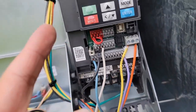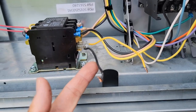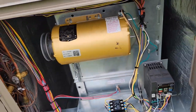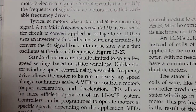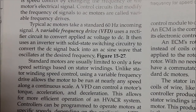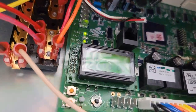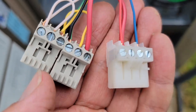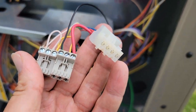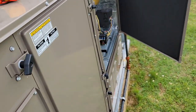These are the wires left on the VFD. I've got a couple of spades connected to some wires, and I'm ready to hook up the wires to the coil so I can energize this motor whenever it calls for cooling. For the thermostat wire connections on the simplicity control, C and G is what I want. I've got a wire connected to the C terminal and a wire connected to the G terminal. So when we get a call for our fan — common and G — we're going to energize our contactor.